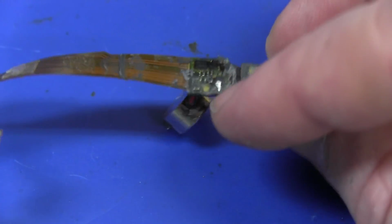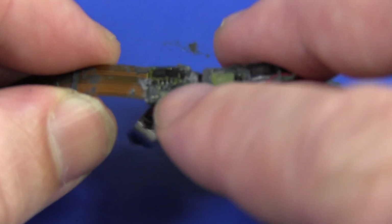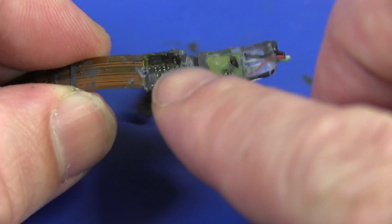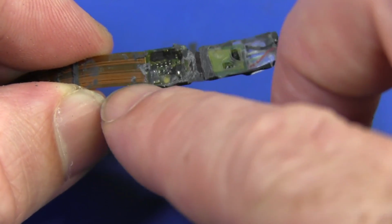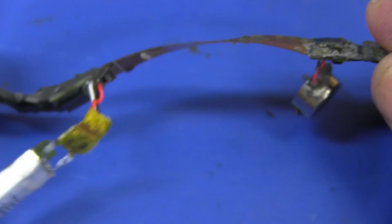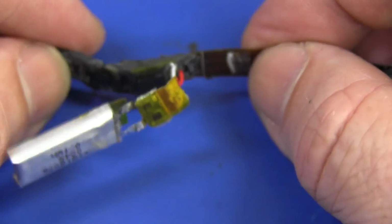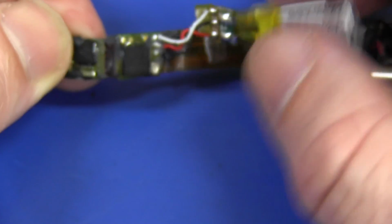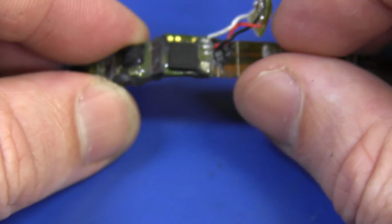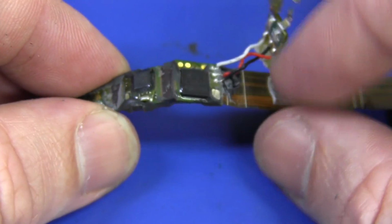And that board, that rigid board, hence why it's called a rigid flex, that rigid board is just sandwiched, as we said before, between the flex material down in there. And that's how you join all the boards together, because you don't. That does the physical interconnection between the boards. So you don't actually need a connector as such. It's all manufactured and sandwiched in as part of the board.